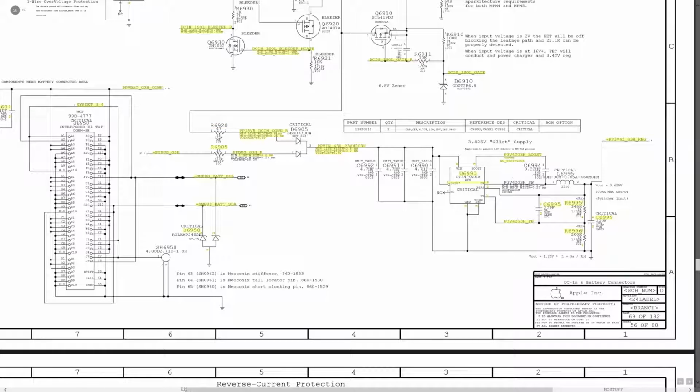The way this works is pretty simple. You have PP3V42 underscore G3 Hot over here. This is one of the few power supplies that turns itself on to create the green light on the charger before any power actually starts getting made for the machine. Well, if all the other power supplies like PP-Bus G3 Hot, PP5VS5, PP5VS3 are not present before this one is, then how is it going to turn on when you first plug in the charger? Well, the way this works is this will actually take the power directly from the charger.